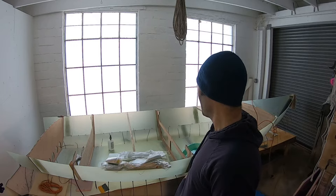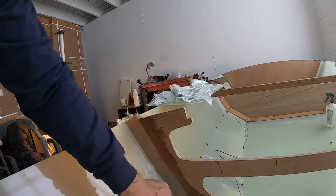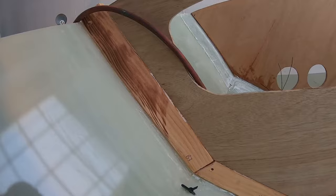This is 2 to 3 weeks into the build of my custom 17-foot first mate designed by Ross Lilystone of Australia, and it's going really well. We have gotten past a small issue that I had in which the scale was off between the frames and the hull. I've dealt with that by adding spacers or packers to go between the smaller frame and the larger hull. Here's another closer view showing the wood grain on the Douglas fir packers.